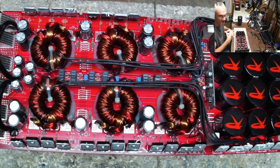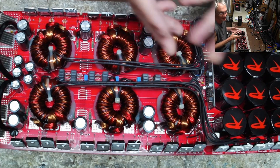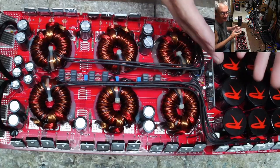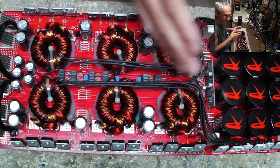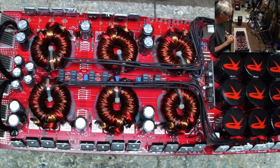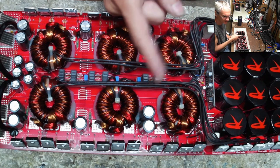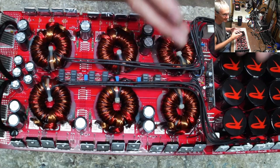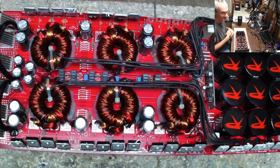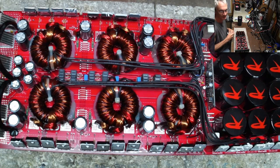I'm starting to see this failure a lot more. Maybe the design of the amplifier is just being pushed right to its maximum level. Maybe SNI could one day incorporate an independent auxiliary supply if this core is getting saturated. The auxiliary winding — I think it goes through an inductor and capacitor with diodes for the regulator, so it may not have a snubber on it. Is high-frequency switching noise causing an overlap? I don't know. If you guys have any ideas, please leave them down below — knowledge is key, and I want to pass it on to others interested in component-level repair.